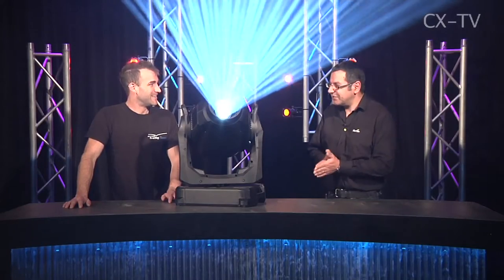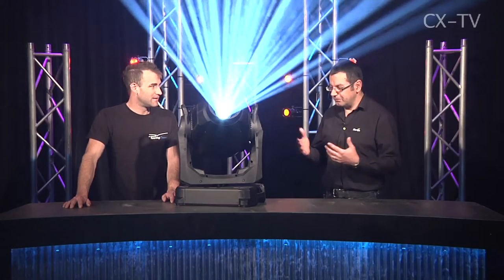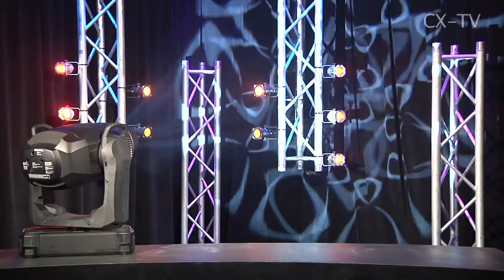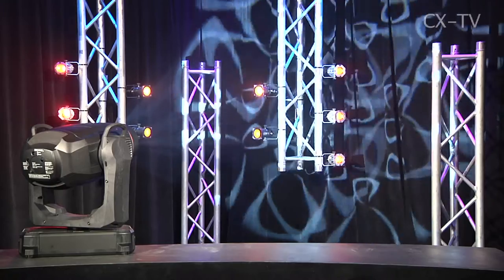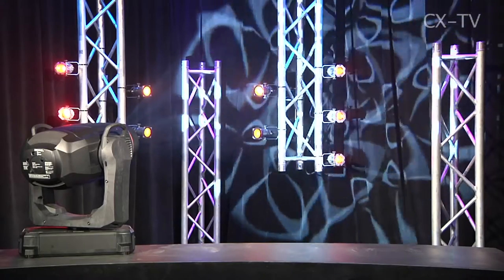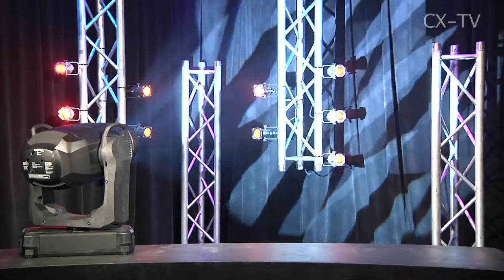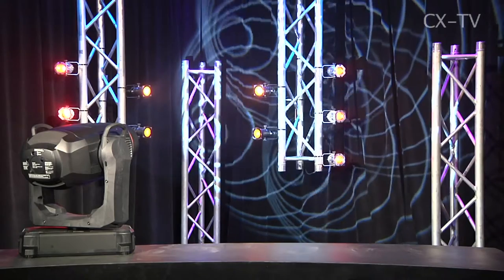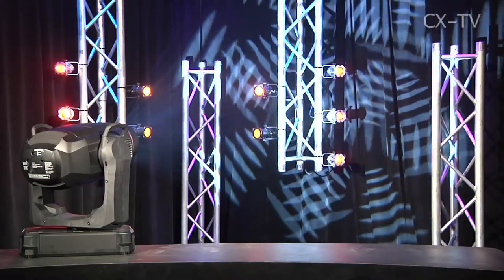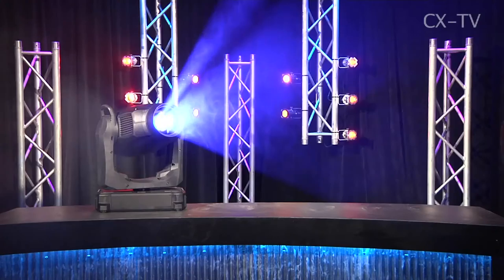Thanks for having me, first of all. Yes, it's a very exciting time for us. As we all know, in the past, the Mac 2000 has been very much an industry workhorse and it's getting on in age. So Martin have produced a light which hopefully will take its place — next gen. So a unit which is 33 kilos as opposed to 50 kilos, which is 26,000 lumens as opposed to 19,500 lumens. A thousand watt lamp, more efficient. The lamp is one of the key factors in this — better CRI than most of the other lamps that are available. And it's cheaper to replace too. The exciting bits about it — the main thing is smaller, brighter, lighter. That's the main motto of their ad campaign with this.